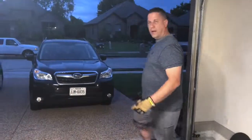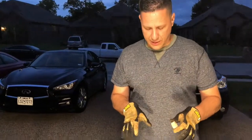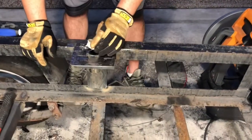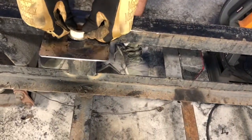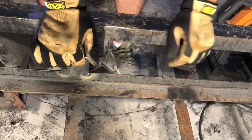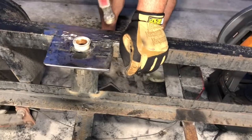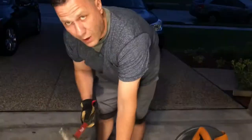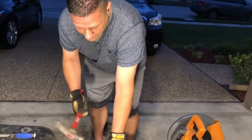I've got one of them put together and I'll show you putting one of those together. There's a bushing just like this, which I don't know where you can get these. I'm actually missing one, so I'll show you what I'm going to do about that. I've got a bushing pushed up in the bottom here already. It's got a little slot right here for where the pipe seam is. I went to the big box store and got some inch-and-a-quarter black iron pipe. The black iron pipe is the same size on the inside — it's quite a bit thicker wall, which is actually to our advantage. The inside diameter is the main thing.